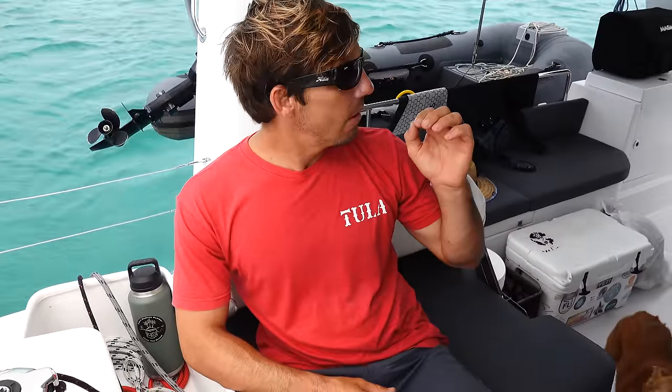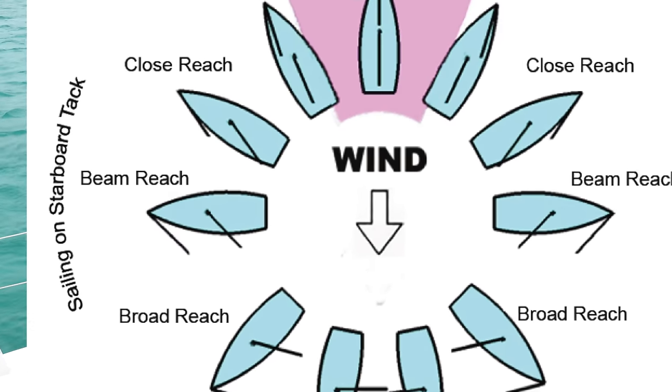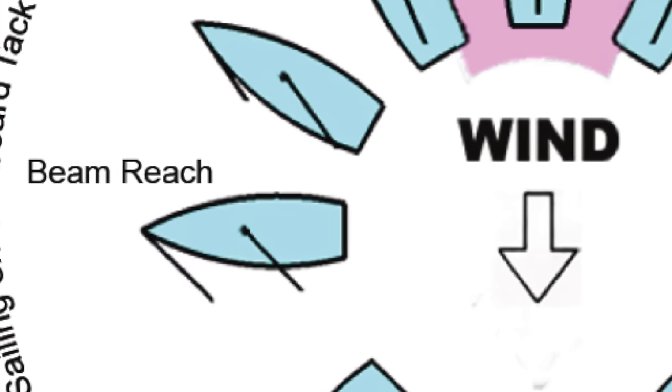Today we have a straight east breeze and we're sailing pretty much straight north or north-northeast, so we're going to be on a beam reach or the wind will be just forward of the beam. It's forecasted to be about 15 knots, so at 15 knots on a beam reach we can have our full sails up. If it was forecasted to be 15 to 20 or over 20 knots, you can anticipate how many reefs you might want in the sail. If it was forecasted to be 20 knots, we'd probably start with one reef in the mainsail.